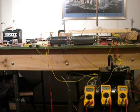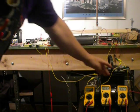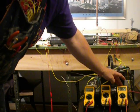Now, what I'm going to be doing here shortly is I'm going to be starting the motor up using the start battery on the left. Once the motor gets up to speed, I will disconnect the start battery and you'll be able to see this in operation. I'll know that the alternator is up to speed when this multimeter here gets up to 26 volts.